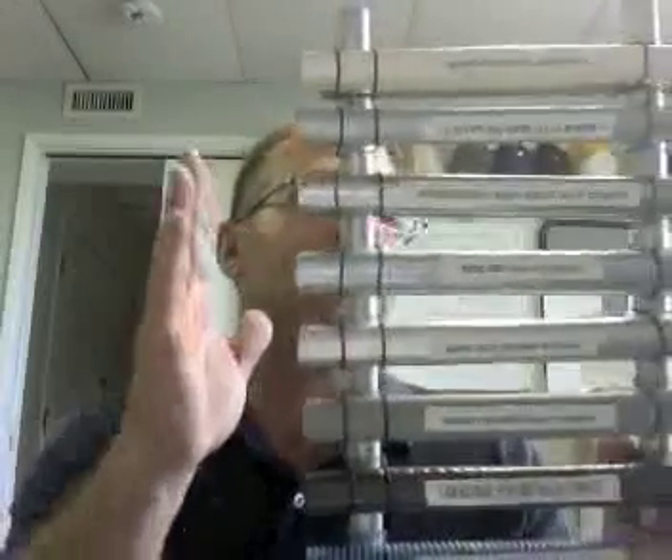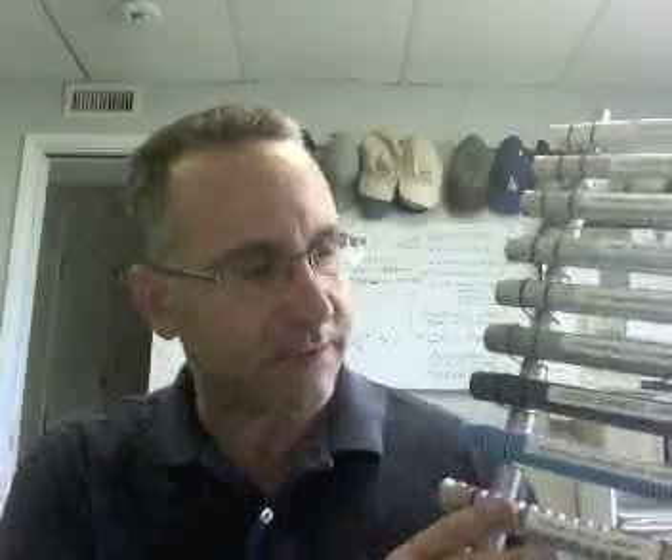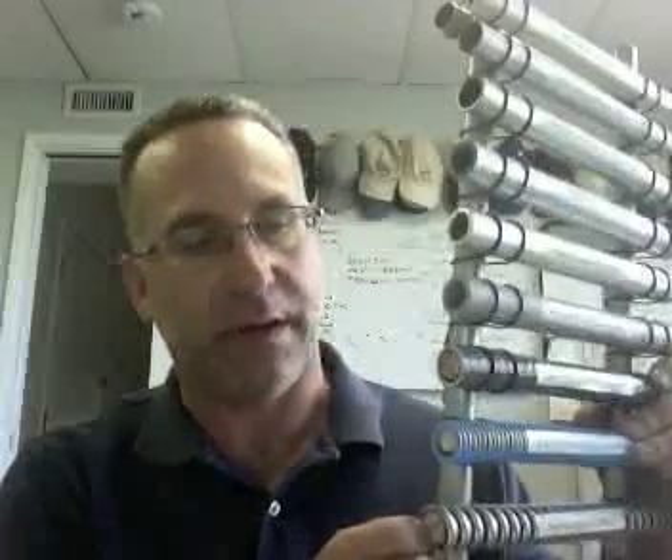The student is expected to produce this project. As you can see, the frame of this project is in half-inch EMT. All the other conduits you see here are also half-inch, except there are various different types and names. Oftentimes when mounting flexible raceway, the conduits will bend, and this student used small dowlings placed inside the conduits to prevent bending. Very good work — this is an A project.